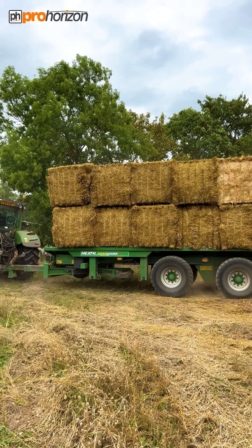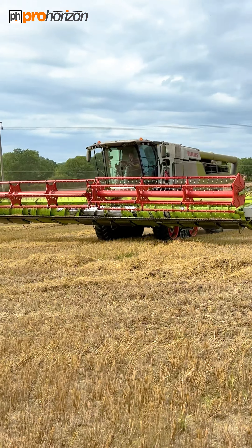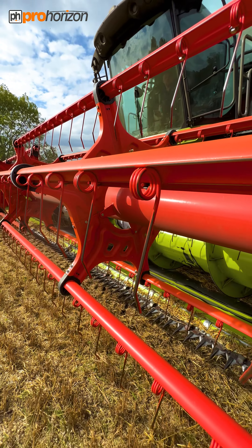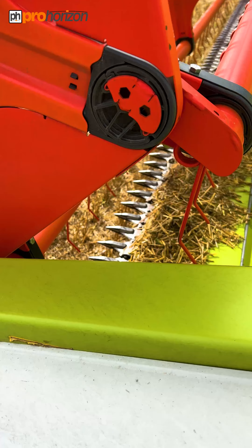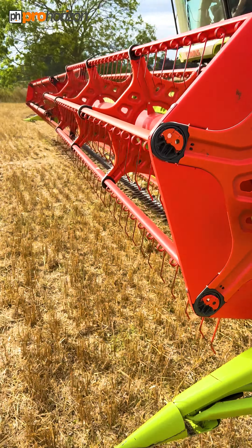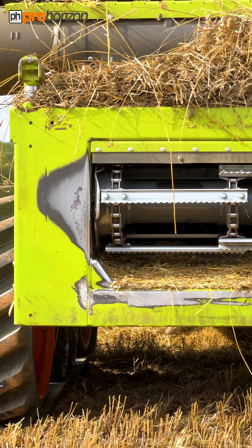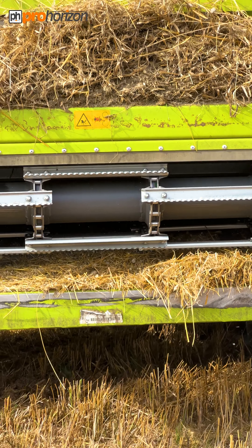Looks a very dense bale, probably quite heavy as well. We've been asked a few times what the actual header looks like, because you normally see it in a crop. Willis is about to put the header on the trailer. On the top you've got the reel — the red reel — that feeds in the crop. Right at the bottom are the knives; I've described them like hedge cutters, and that's pretty much how they work, back and forth. Down there at the bottom you've got an auger, which is like a corkscrew, and that feeds the crop to the centre where it goes into the combine for threshing, cleaning, and processing. Inside you've got the rasp bars, and that's where it gets fed in — the rasp bar spins around and takes the actual crop into the combine so it can be processed.